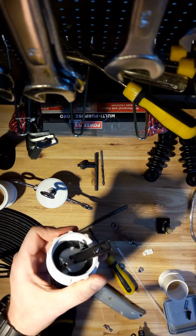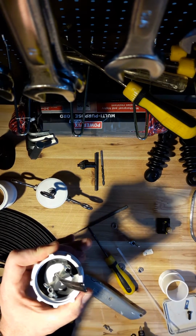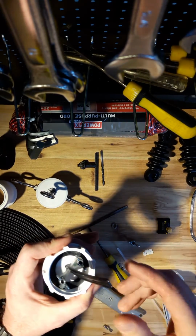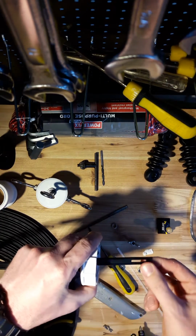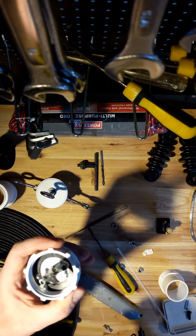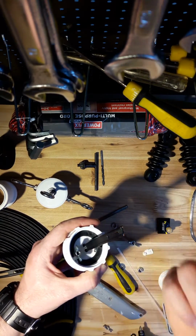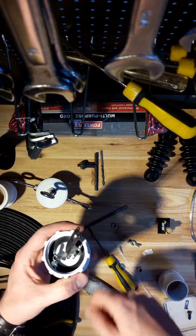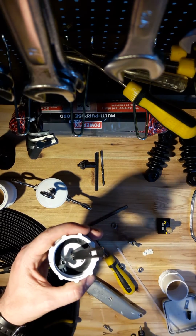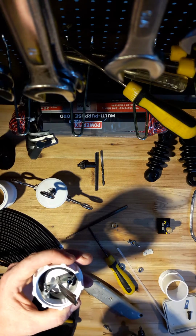Those heavy duty cable ties, you know yourself, if you've ever used them, you can tie on hubcaps on cars or whatever, they're practically indestructible. And the plastic in the open wire feeder seems to be strong enough to hold itself in place. The reason I use these wing nuts is so I can loosen them, take the cable tie out and remove the cable if I ever need to. If the antenna gets damaged or whatever, you want to leave access to certain things.